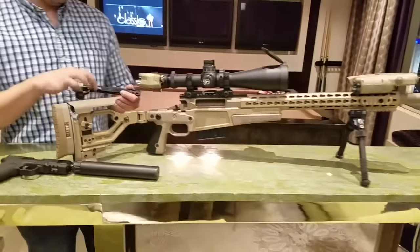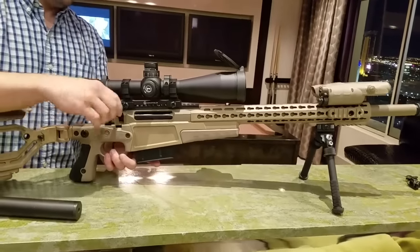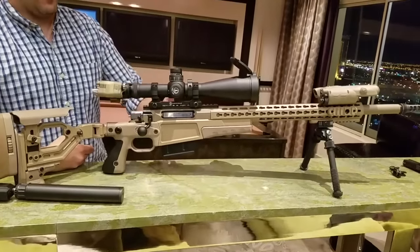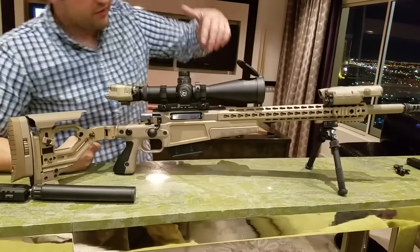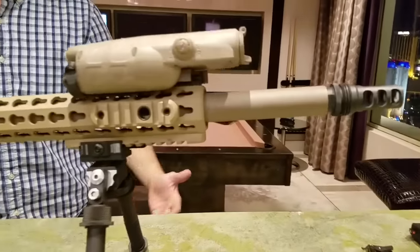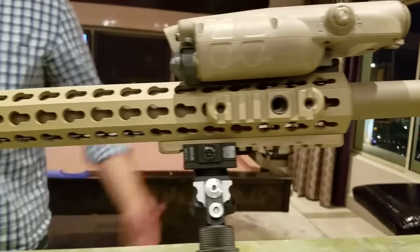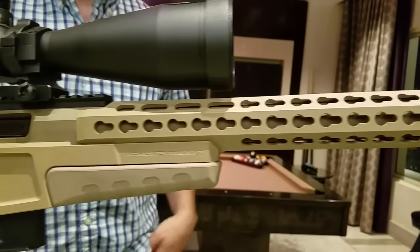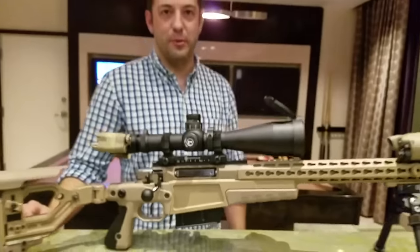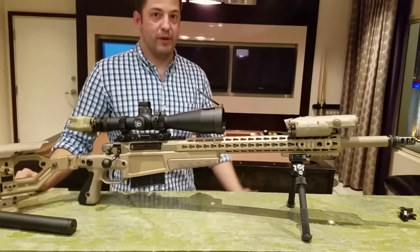We firmly believe you could put a six-wrap door charge in there and it would just take it — same thing with the barrel and the chassis. We actually have to machine the chassis to fit this action because the chassis is designed for a round-bottom action like the Remington or the Surgeon. We have to square it off and inlet it for the two integrated recoil lugs built into the action. The barrel is done in-house — it's a cut-rifled barrel, not button-rifled. We do it on the same machine that Krieger uses, a 1937 Pratt & Whitney hydraulic. Single-point cut rifling is still the best way you can make a barrel.